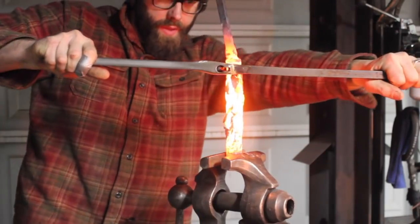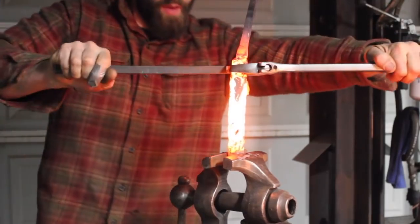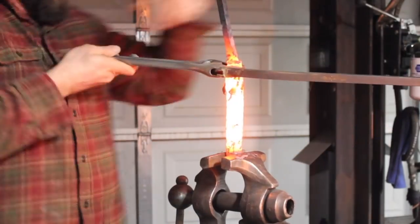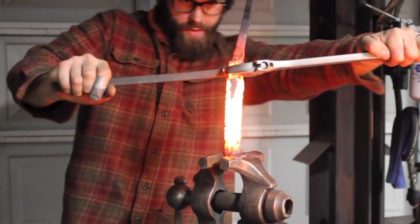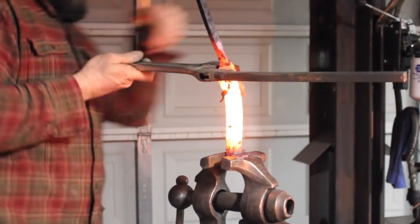And this bar, I've knocked the corners off on the press. It's not round, but it's more octagonal, I guess. And I'd say 1.125" wide. And I had it in and out of the forge, I think 4 times, like 4 different heats to get the number of twists in it that I wanted. And I did not count them, but went pretty tight on it.